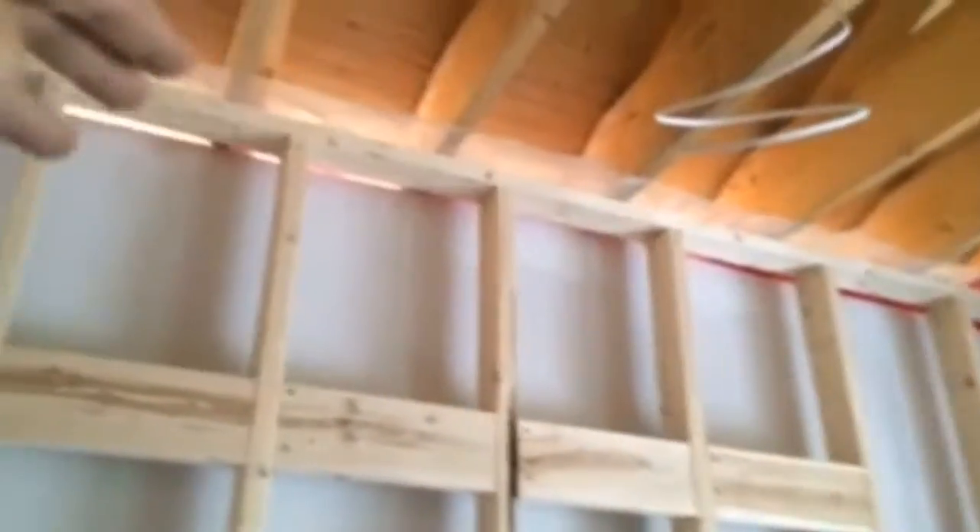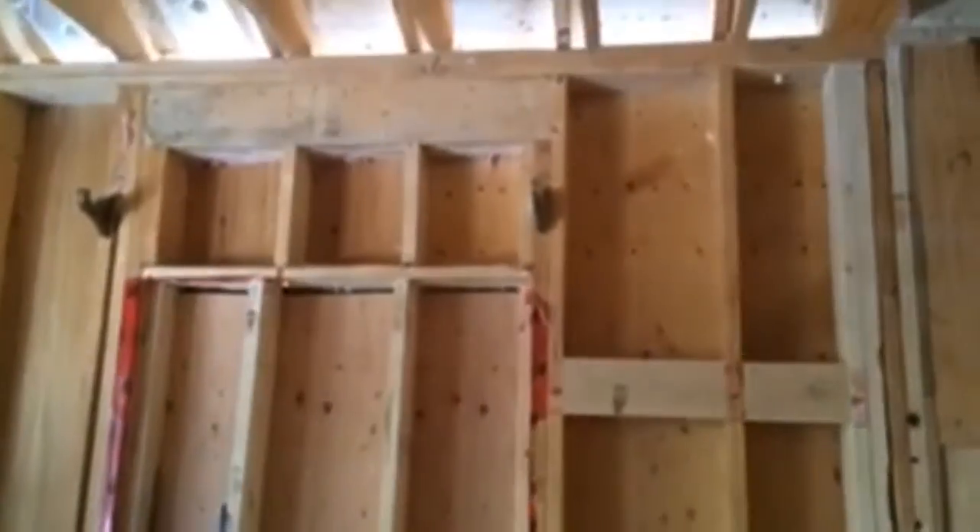We've already got some boxes and switches wired up. However, before all this even takes place, the first few stages would be the homeowner and electrician actually meeting on site and walking through the physical space and planning out what sort of lighting requirements they have. For example, if there's a bed on this wall, maybe they want some pillow lighting, which is basically some pot lights on the ceiling that would shine down over the head of your bed when you're laying in bed so you have something to read with. Another instance would be over here, we've got some wood blocking where the homeowner desired to hang some artwork and there's going to be a wall sconce over here shining down over the artwork. So any specific requirements or general layouts of lighting plans that the homeowner wants would be covered in this initial meeting.